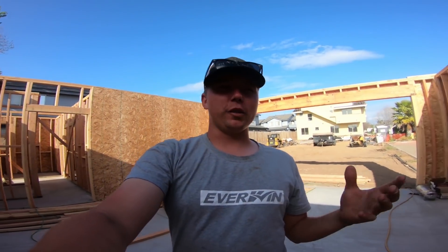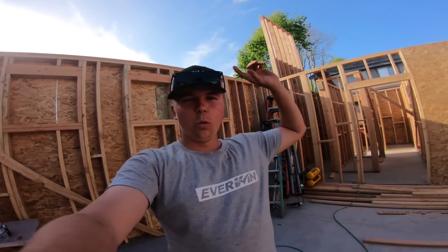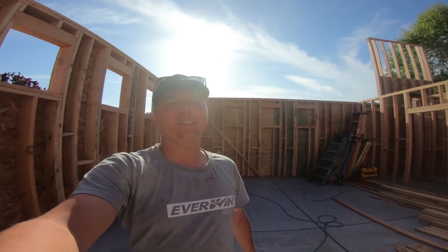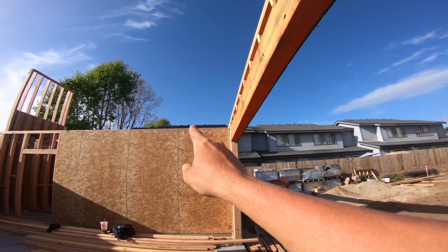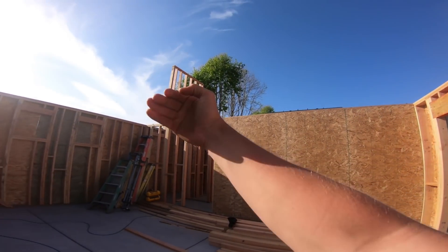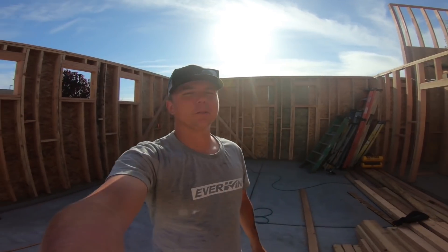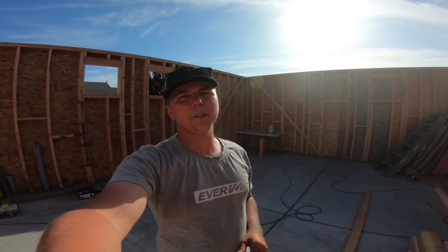It always amazes me - part of why I love my job so much is seeing how much two guys can get done in less than a week. We are ready for the floor system. We'll get that going and shoot it out in no time. Next thing you know we'll be up top framing walls. There is a pretty cool detail - we have a cut-and-stack roof. That PSL is set back three foot nine, runs across here, and then two-by-four rafters run off of there creating like a little eyebrow effect all the way around the building, and all the way over to the entryway with the stairs cutting up above it. That is it for this episode. Subscribe to my YouTube channel, leave a comment below, big thumbs up. Check me out on Instagram at Matt Bangswood. See you guys next time.